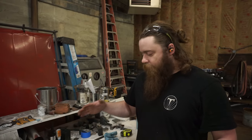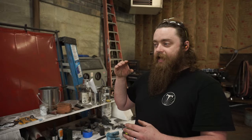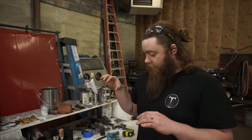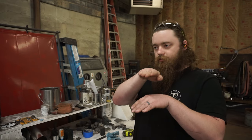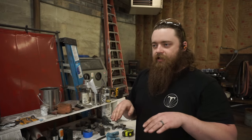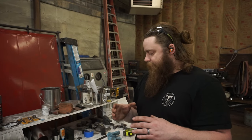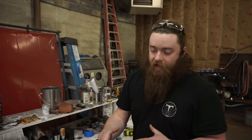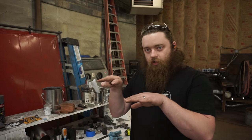Surface ground 1-inch square with our variety of patterns. We're going to go through and measure each bar up, and we're going to lay it out in a 9-way weld. So we're going to take those square bars and orient them in a pattern, 3 across and 3 up, and mix and match them a little bit, and we're going to weld that all into one bar, draw that out, and we'll probably 4-way it again after that, but for now it's going to be 9 1-inch bars, 3 over, 3 up. So let's do some cuts.